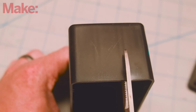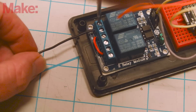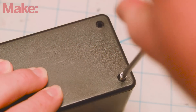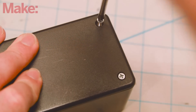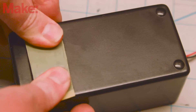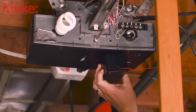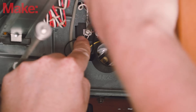Cut a hole large enough for the USB cable into one side of the top part of the enclosure and a smaller hole in the other. Mount two lengths of wire into the two outermost terminals and feed out the small hole. Screw the enclosure lid into place. As much as it would be convenient to simply mount the base plate to the underside of your garage door, we've seen some unreliability from these relays when mounted in this way. Place two pieces of Velcro tape under the top of the enclosure. Mount the enclosure to the underside of your garage door opener and connect the two wires to the terminals we identified earlier.